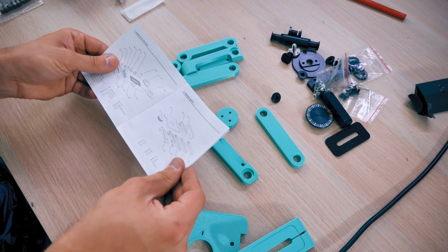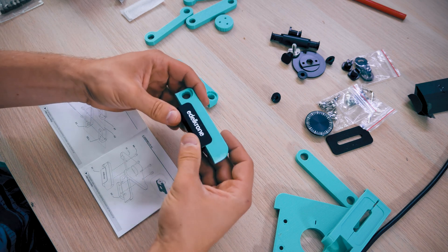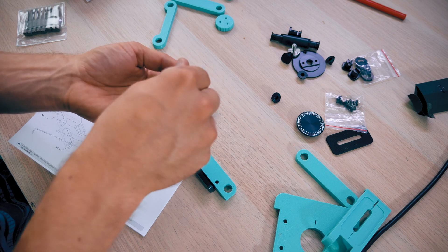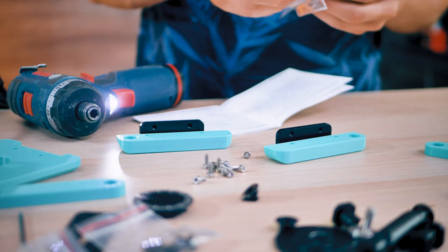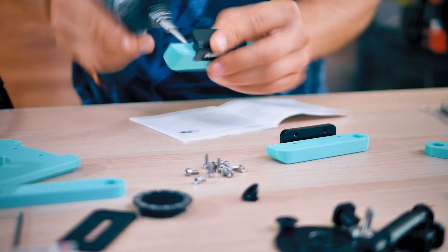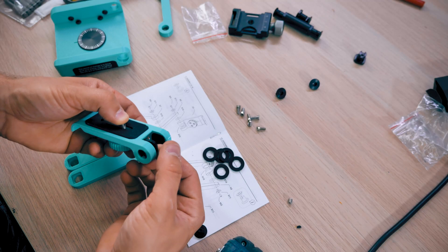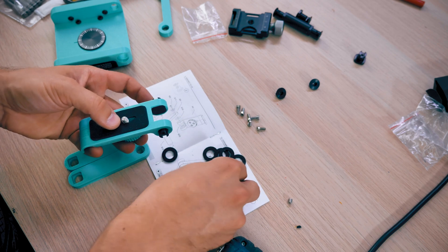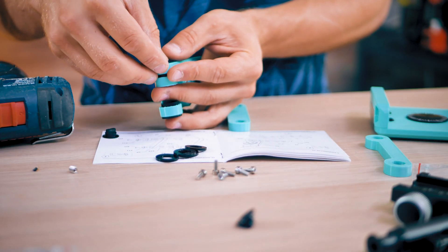The aluminum parts almost snap into the prints, even though there's no snapping mechanism here. There's no slack in any of the parts, which is great, since you don't want the finished head to wobble around. It's all just one size hex key that you need, but I used my trusty cordless screwdriver because A, it's way faster, and B, I can set a torque limit to consistently tighten the M3 and M4 screws. The joints are two-part pieces that tie the arms together and clamp the printed parts against an aluminum shim — you can't really expect consistent friction from rubbing two PLA parts together, so a shim helps with that.